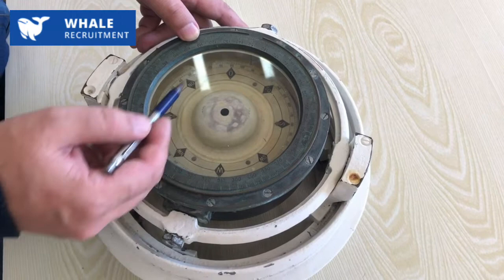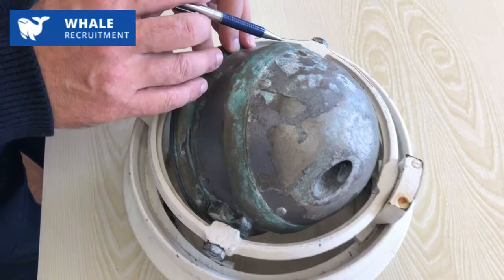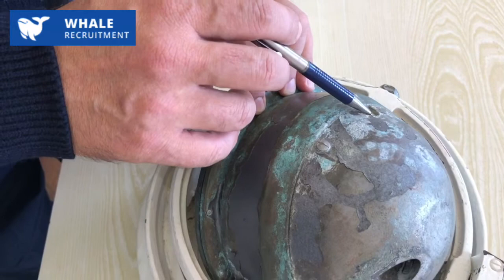What is important when using a magnetic compass? Check from time to time — check the compass for the absence of air bubbles, and refill the liquid if necessary. In order to do this, turn the compass upside down, open it very, very gently because the screw is made of very soft metal, and slowly add liquid drop by drop.